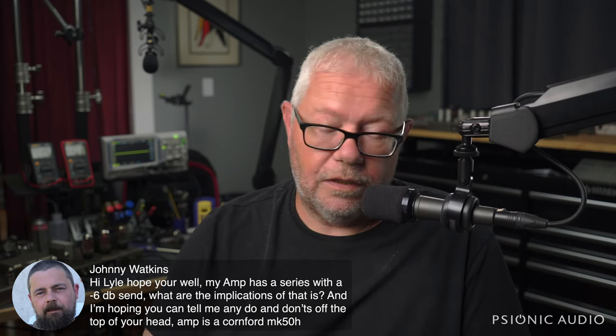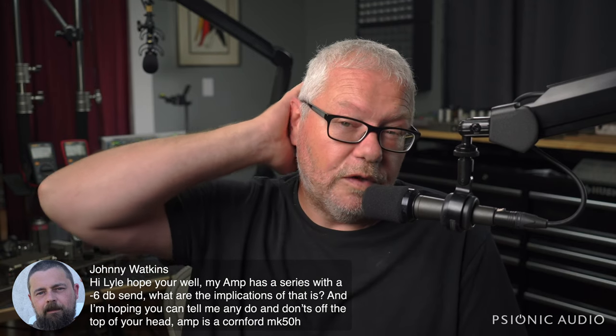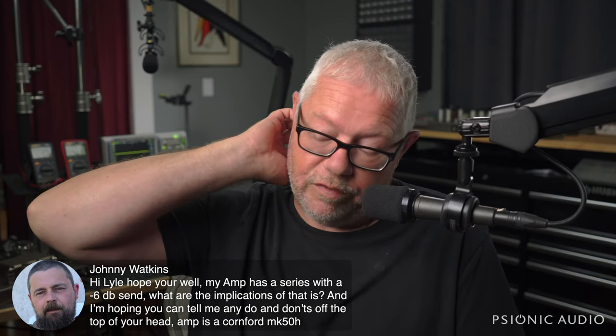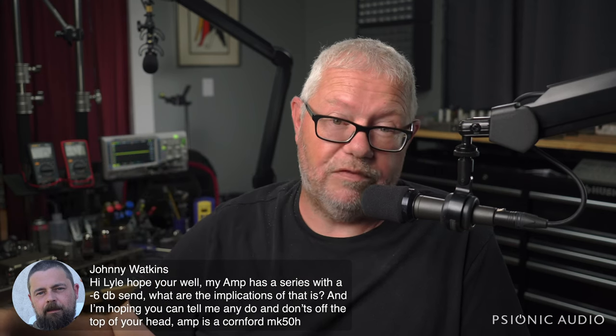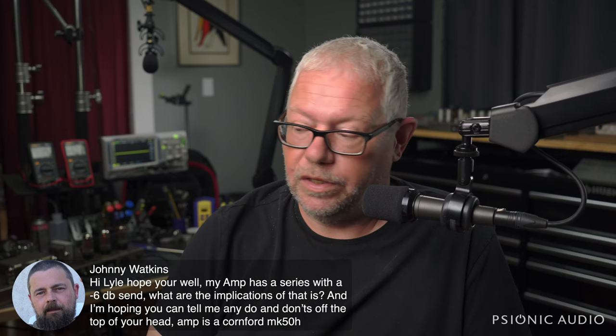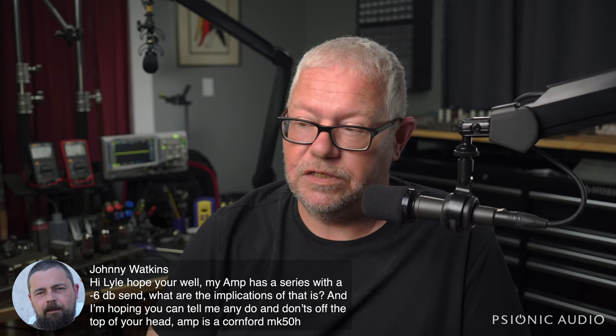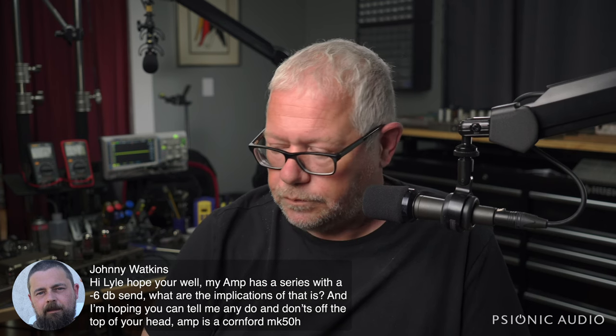So if I plug my Strat into something, the line level there is nominally -30. So if I go into an old analog delay pedal designed for that, it's going to be fine with that. So an old analog delay is going to be fine with -30 as an input. If I were to run a -10 input into that analog delay, it's going to distort to hell.